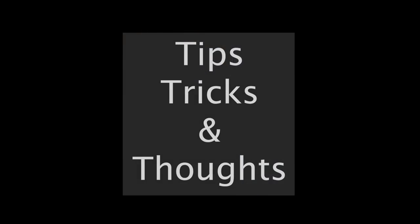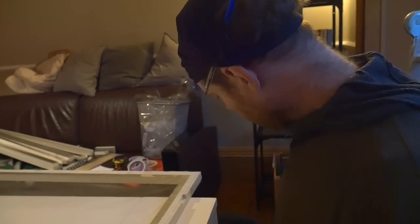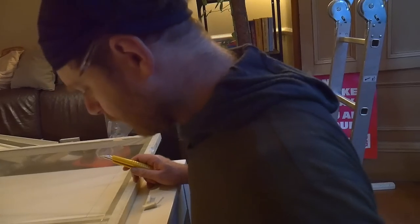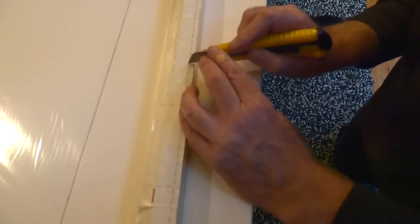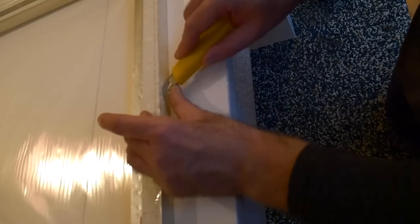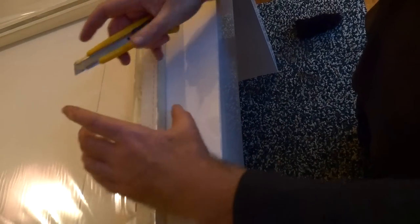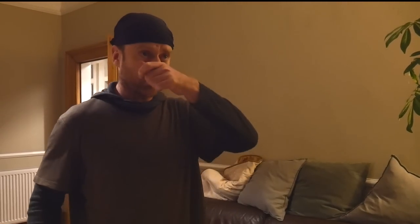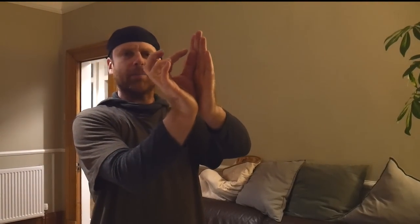Here are some additional tips and thoughts. For incorporating hinges, handles, or whatever features might be on the window frame that the unit would otherwise hit against — just mark where they are and carve out little bits of board to accommodate them. If they're huge, see if they can be taken off. If they can't, there's a possibility of using a fatter board. If you make the frame too small it won't hold itself in. You can make little friction grab points just with some tape, bending it over on itself at the corners, to meet those couple of millimeters to the frame. It weighs nothing, so it doesn't have to be a perfect fit.